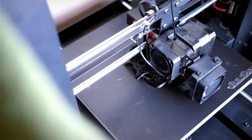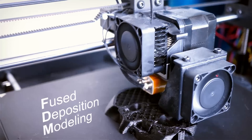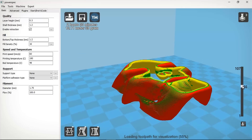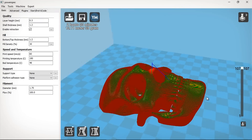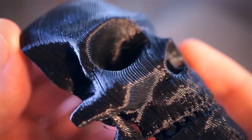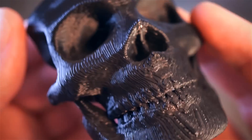The most common kind of 3D printing is called FDM, Fused Deposition Modeling. That is where each layer of plastic is melted in thin slices that are stacked vertically. But therein lies a problem: when your model has sharp curves or rounded surfaces, a very noticeable stair-stepping occurs.